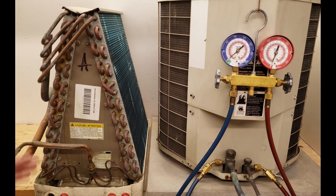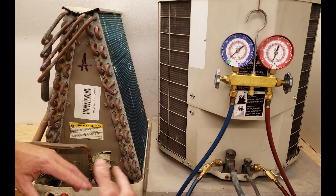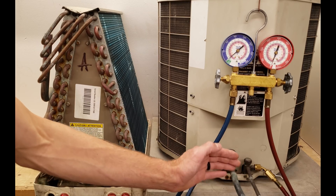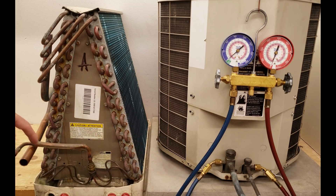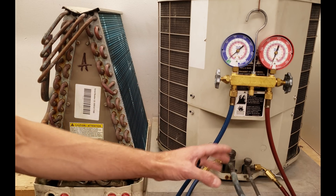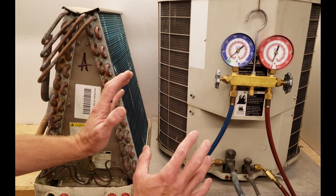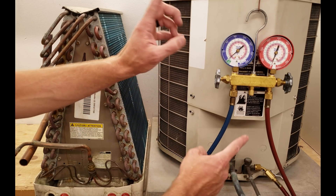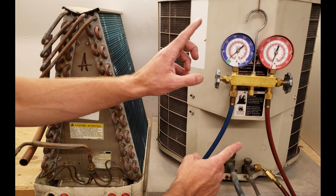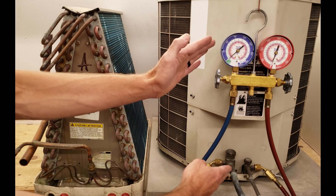The fourth reason is that total superheat at the outdoor unit and superheat at the indoor coil are normally very close — within about a degree of each other — unless the vapor line is extremely long, there's some type of pressure change between the two points, or the tubing runs through the ground. In most cases, the superheat at the indoor coil is going to be extremely close to the total superheat at the outdoor unit, which is why we set the refrigerant charge for a fixed orifice system with the total superheat method. It's essentially a one-stop shop.